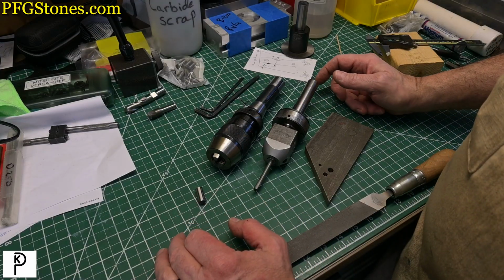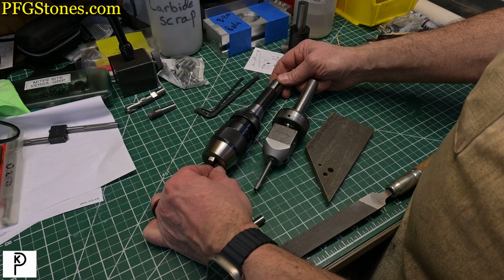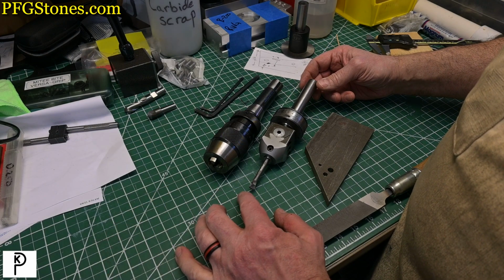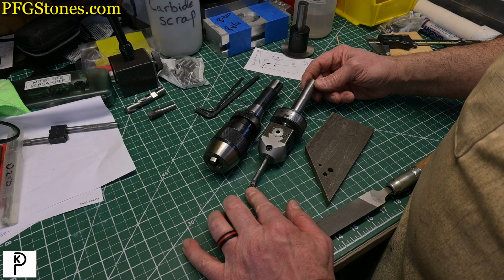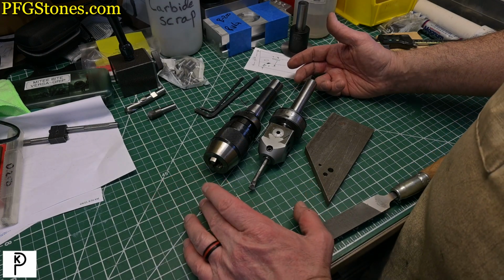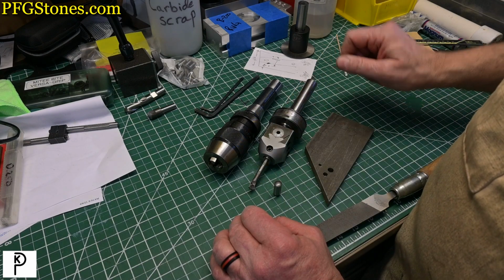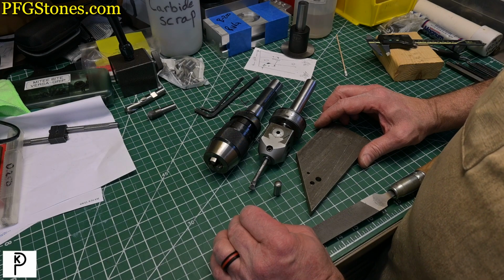Okay, here's the game plan. So the game plan is that we're going to drill an undersized hole ready for boring. Then we're going to use our newly bushed MariTool boring bar in our Criterion holder, and we're going to bore the hole. And then normally you might choose to ream or lap the hole, but we're just going to see if that'll get us to a good 10 millimeter fit, and we're going to use a scrap piece of steel to test it out.